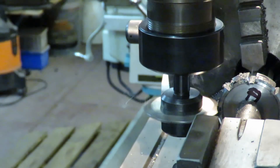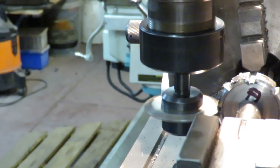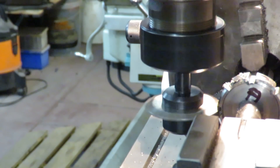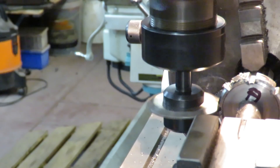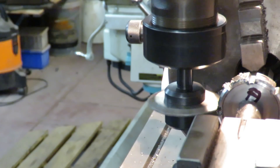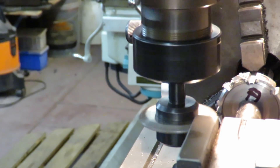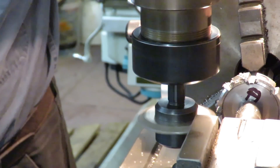Our shavings are very, very tiny. We're shaving 3 degrees at a time. There's no effort at all for the mill, no effort at all for the cutter — it comes back without any noise. So we're going out from 48 degrees to 93 degrees.